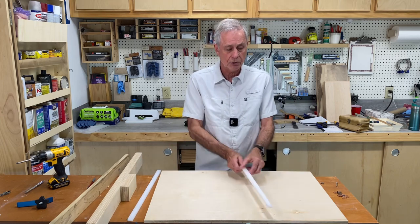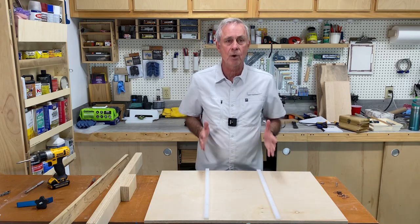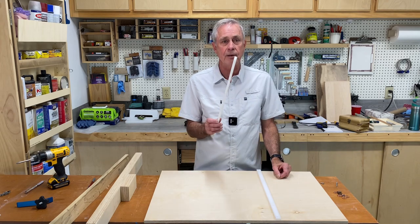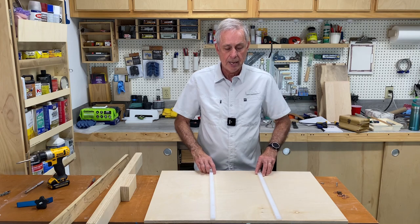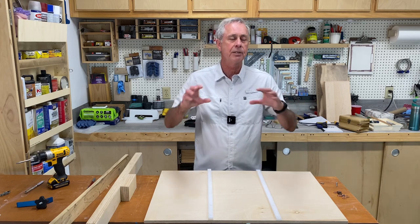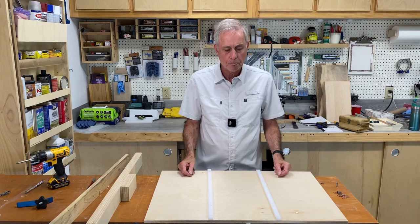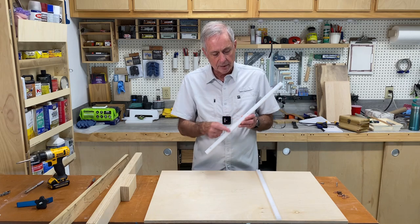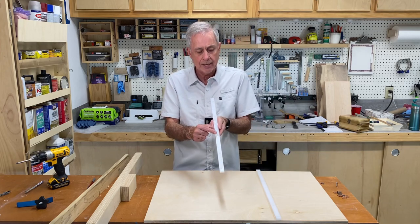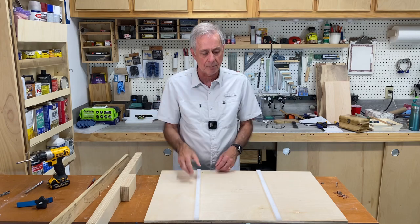You're going to need runners. These runners fit in the slots of your table saw to keep your sled running straight and true as you go through and cut your miters. I used polypropylene — I had this plastic laying around and cut it down to the size I needed. If you don't know how to make runners for sleds, there are a bunch of videos out there — go check them out. On the bottom side of the runners, you'll want to drill through and countersink so your screws go all the way in and won't rub against the top of your table saw.